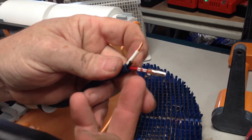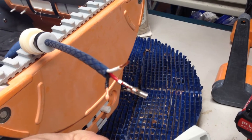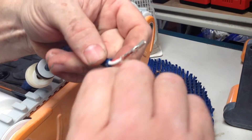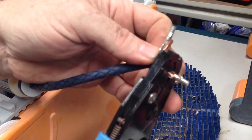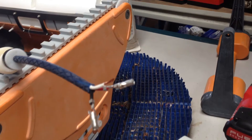The copper goes into the crimp so that it bites around the insulation — that'll stop the wire pulling back out. We go for the next one, in the middle gutter of the crimp, click and hold. I'll just re-twist this. Again, riding onto the insulation. Into the final crimp now, again in the middle gutter.